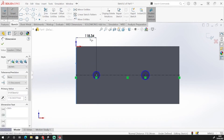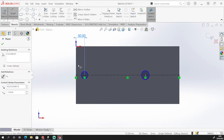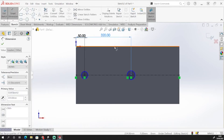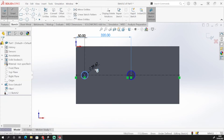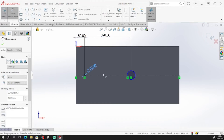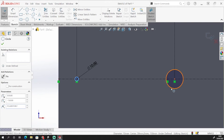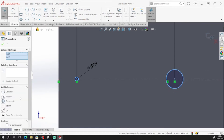It means I don't have to dimension up the distance from the edge to each circle — I put that centerline in so they're fastened and attached to that. All I need to dimension up is how far I want them along. My first one is going to be 50 along, and my second one from the same edge is going to be 320 along. I do need to set the size of these — they are going to be 10 mil diameter. Once I've set one, I can click it, then hold control and click the next one, which brings up the relationships I can use. I'm going to say I want both circles to be equal, so it'll make them the same size.